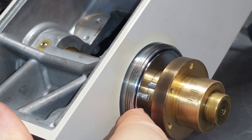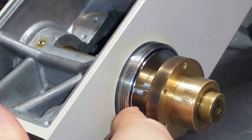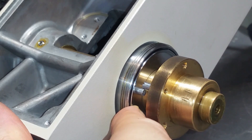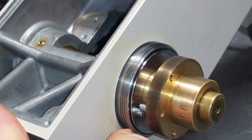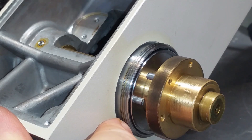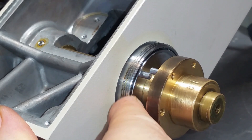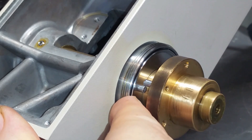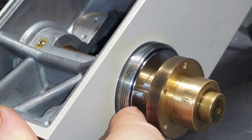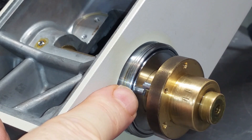So that's the basic way the lock works. But to really explain it, we need to explain the spring. The whole purpose of the spring: if I rotate the coarse focus knob in the direction to raise the stage, it'll push the lock ring around — by the geometry, it has no option. If I go the other way, they separate. And that doesn't work, because in order for this lock mechanism to work, this lock ring needs to follow the coarse focus knob so the pins are always in contact whether going this direction or that direction. If there were ever any gap, it wouldn't be locked in the proper position. So that is the purpose of the spring — to keep these two pins in contact.